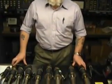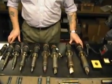Today we want to discuss basic soldering iron maintenance demonstrations to help you properly maintain your irons and hopefully extend the life of not only the elements in the irons but also the soldering iron tips. We get calls often where somebody thinks that their soldering iron element is going bad. The way our iron elements are made is a compression coil wound nichrome that is either working or not working. So generally what you have is a problem with the heat transferring from the soldering iron element into the tip of the iron.